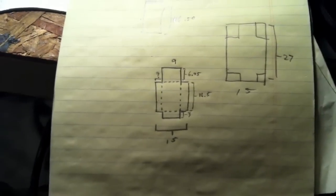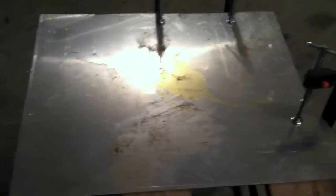Of course, you can make your own design if you just want it to go straight underneath, but I would like it to be kind of all encased, and that way if I did slide around or something to hit it from the side, it's going to be hitting the skid plate instead of the side of that plastic. So definitely recommend you get underneath with the tape measure and find the measurements yourself. It's very simple. It took me less than 5 minutes, and then I cut out a big square. That's step one.